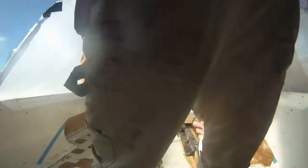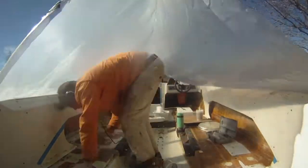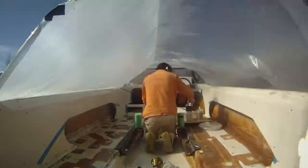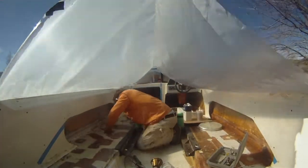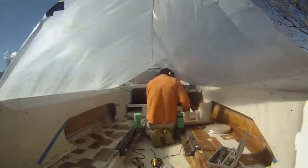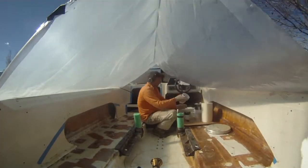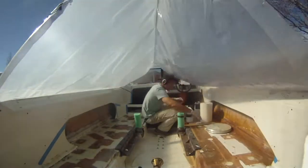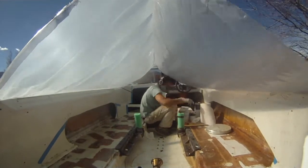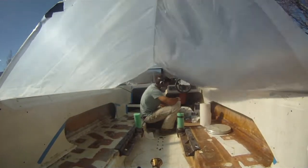Today I am gel coating the floor where I fiberglassed. I found out that the quicker you get the gel coat onto the laminating resin, the better bond you'll get, so I really wanted to make this happen before the snow comes in. I did a little bit of dremel work — I had just a little bit of bubbling in those big laminates of fiberglass — so I figured I'd dremel them out, gel coat over them, and then be able to find those holes where I dremeled through the gel coat and finish carving them out at a later date.